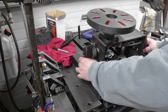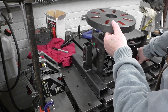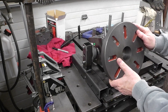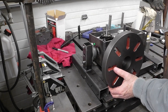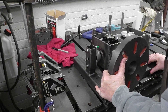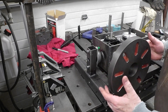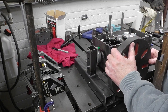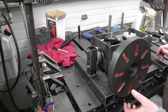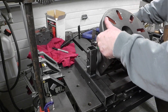I've made the frame and welded up all the pieces. Right now I just have a piece of round stock underneath here to stop it from tilting too far. I've made it so I can tilt it almost 90 degrees — about 88 degrees — so that's about as far as I can tilt it with the table completely over. If I put the small six-inch chuck on I can actually rotate it all the way over. I'm going to make a stop for this with a little bracket and an adjustment nut to adjust it as far as I want. Right now this little piece of round stock just sits underneath the table to stop it from folding over.